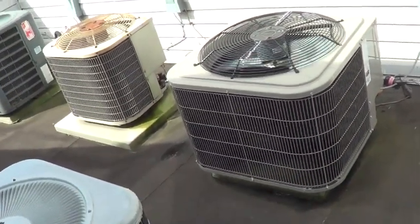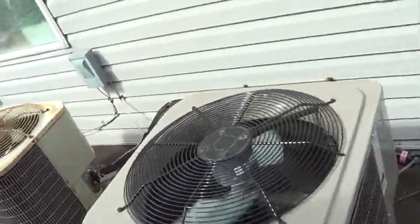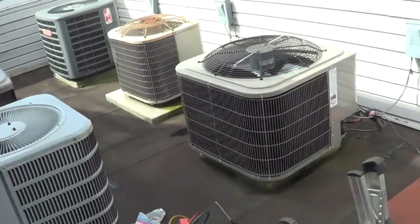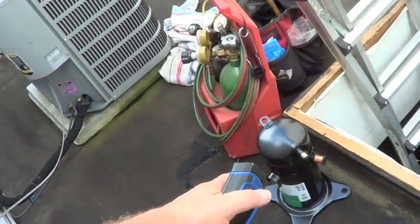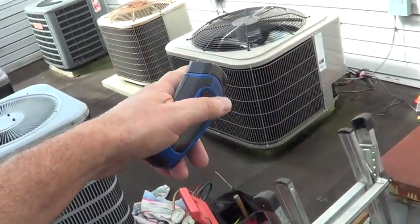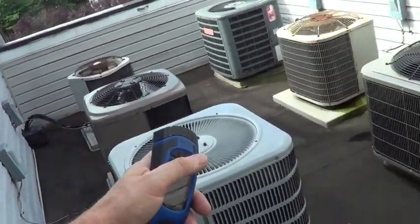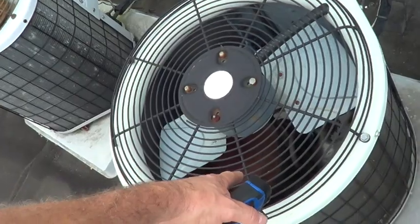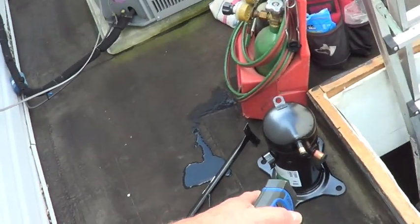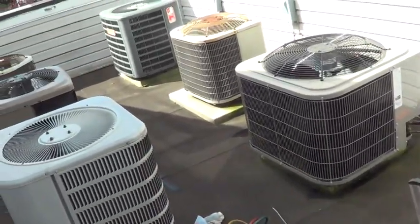I have a unit here, it's only eight months old and it's got a bad LG compressor - it's turned to an oil pumper with much low capacity. I'm going to show the swap out: change the compressor, change the filter dryer. This was a piston system. I have a feeling these compressors cannot take any flood back. On older piston compressors they can handle extra refrigerant - they act like a suction accumulator because they're so much bigger. These scroll compressors can't really hold any of the refrigerant, so I'm going to convert that to an expansion valve.